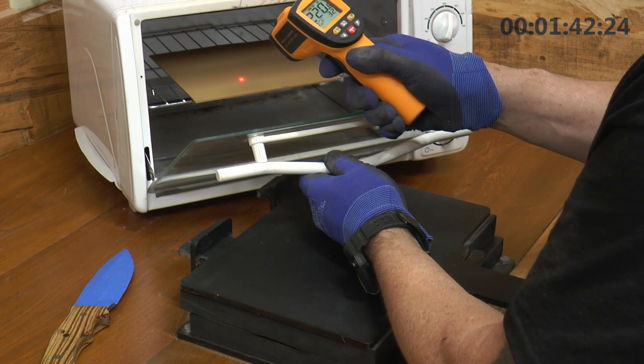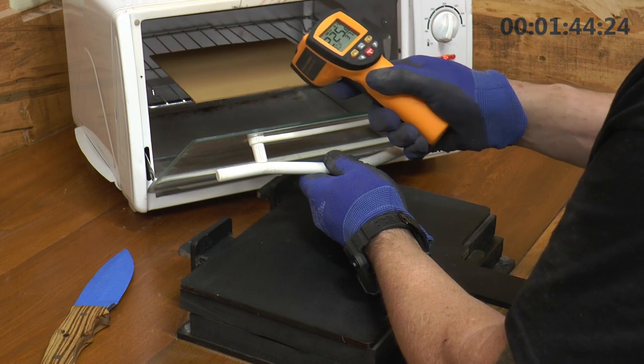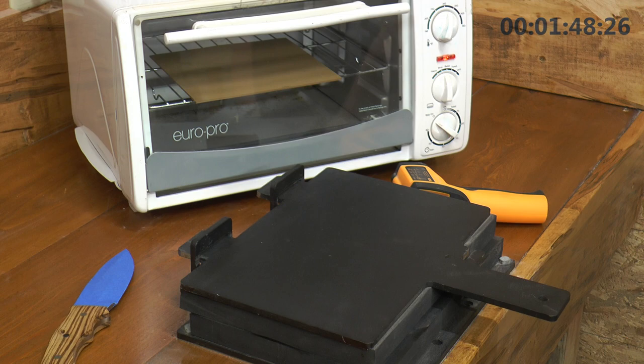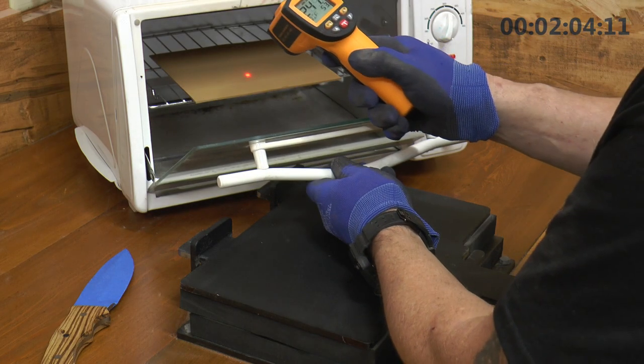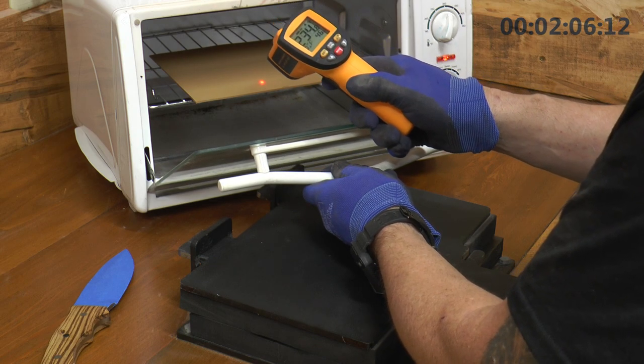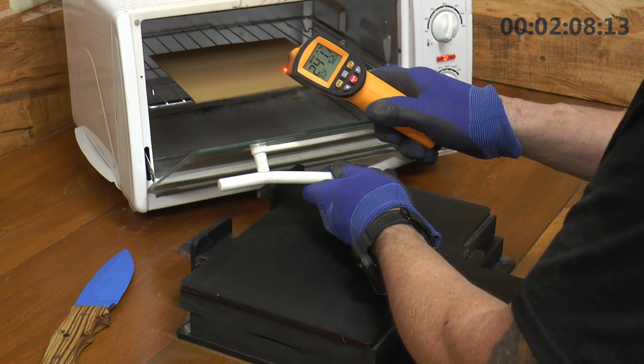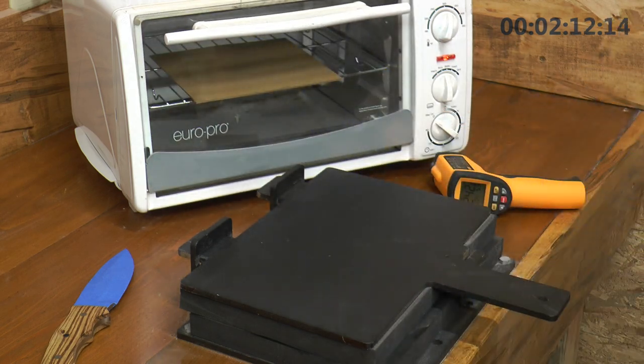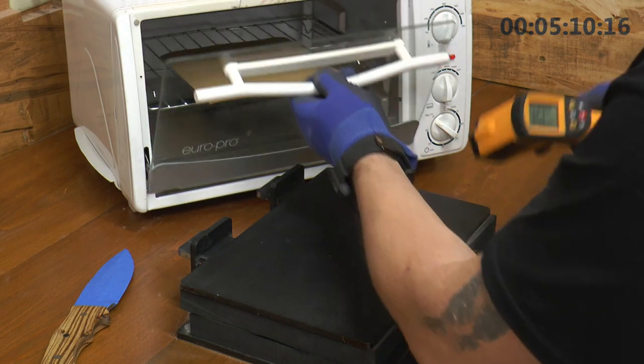It will work. The important thing is to make sure that you get your temperature right. And really, more important than the temperature is simply to make sure that over the edge of the rack, if you're using this, it just folds down nicely. Once it's folding down nicely, it's about the right temperature. You can be on this thermoplastic anywhere from probably 325 to 360 degrees and you'll be fine.